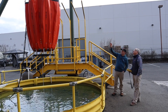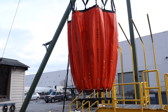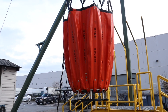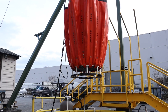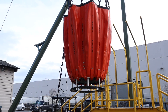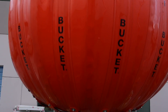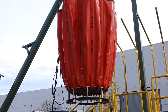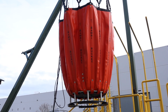How is a Bambi bucket actually made? It's not leather — the material is called an engineered fabric. Essentially, the core of it is like a weave or mesh of material, think like a door screen. This particular one actually has two different materials at right angles to each other, and then that material has polyurethane overlaid on top of it. The inside material provides the strength, and the urethane gives it the wear resistance.